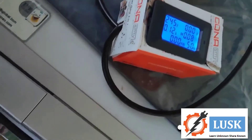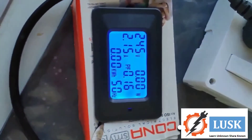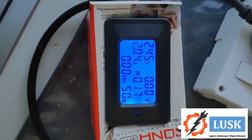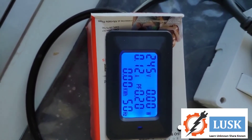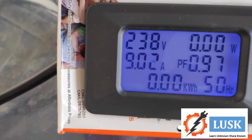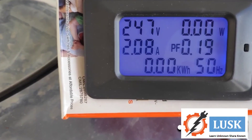Let's see the maximum conceivable load, which is the washing machine. It is a non-inverter washing machine. As per the nameplate it should draw around 10 amps. Initially the ampere is 2.1 to 2.2 and power factor is 0.2. When the motor is running with no load, power factor will be low; when the motor is running at full load, power factor will be at maximum — and that is exactly what is reflected here. When I checked at full load, it was taking around 8 to 9 amps and power factor came to 0.9 maximum. So I think the power factor measurement is working well. The only problem is watts and kilowatt-hour not working.